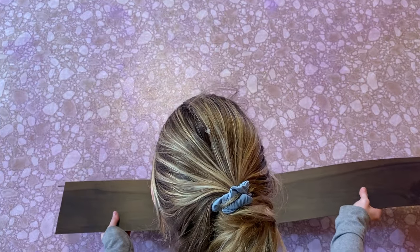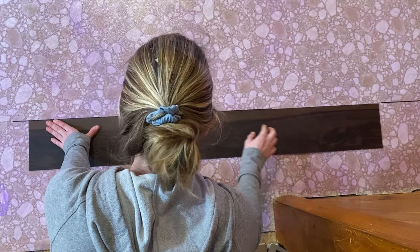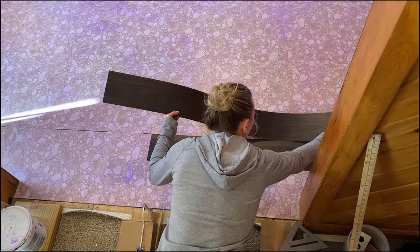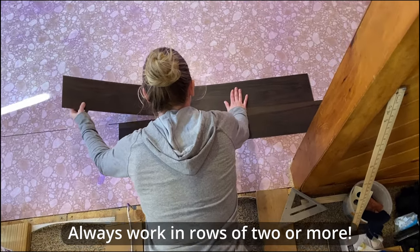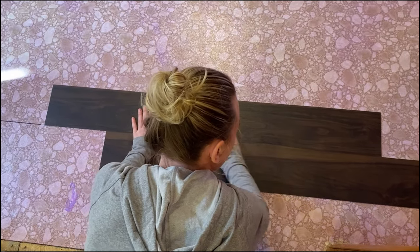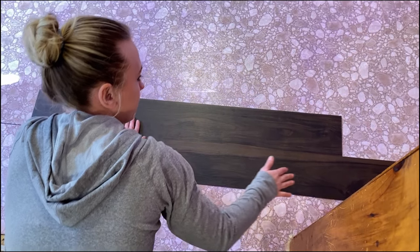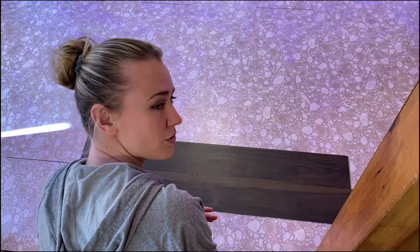So the first plank is going down. We have those lines we drew. Instead of going and putting the second plank next to it right away, I'm actually going to put it up against this one so we're working in a row of two planks — that's just going to help us stay straight. Try really hard not to make a pattern as you go about laying your boards. You want them to be spaced randomly, and it just looks so much better and it's actually easier to make it random, so just go that route.